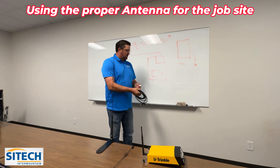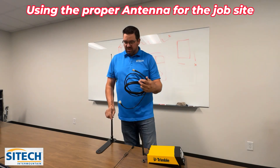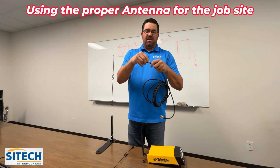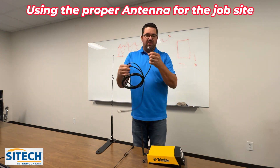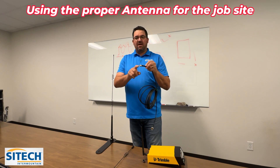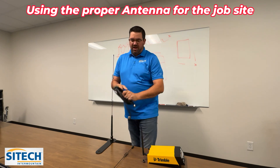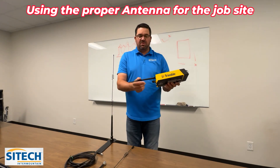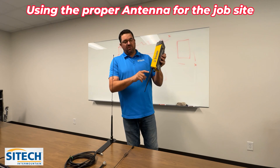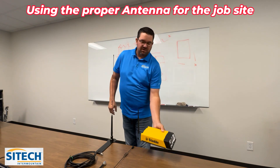The other thing to look out for is the age or abuse happening to the cables that go to these taller antennas. They're known for breaking inside. The coax will fail if it gets bent, wiggled, or sits out in the wind whipping all day — metal can only bend so much before it breaks, and it may look okay externally. We see a lot of failures right at those cable connections. Same goes for antennas on your machines: if they sit out and whip in the wind for a long time, they can be damaged internally and cause you to struggle to get signal from the base.